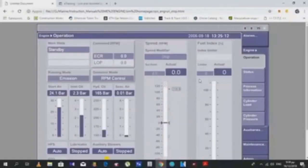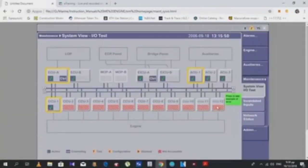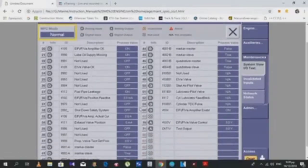We can see from the MOP monitor the same thing we see inside the engine control room. We go to Maintenance and then to CCU, where we can see it is working under normal conditions. Here is channel 70, which controls the FIVA valve. There is no alarm indication. We can also see arrows — one symbol going in and another going out — indicating output and input signals.